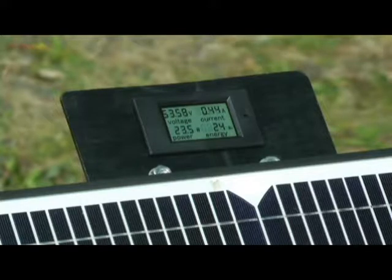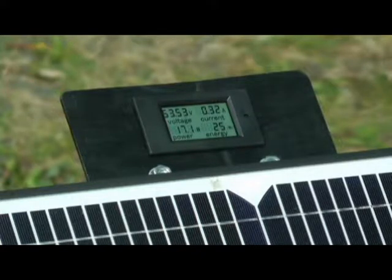There is no charge controller on this system. The way I decided to tell when it was fully charged: I first charged up the battery until it was fully charged with the factory supply charger. Then I immediately plugged it in, took the battery and plugged the solar power into it, and monitored the voltage, which was 54.77 volts. So I realized that was full charge. Now I just charge it until the meter reads 54.77 volts.